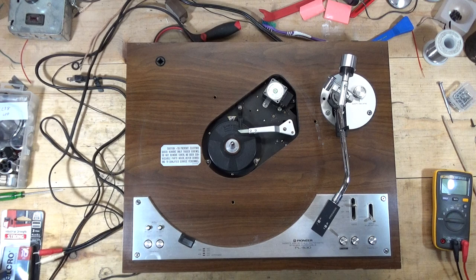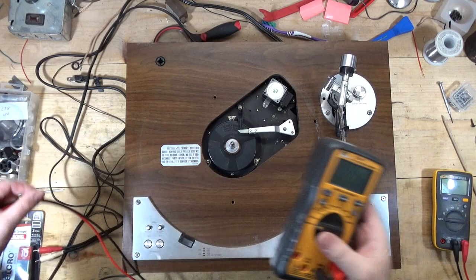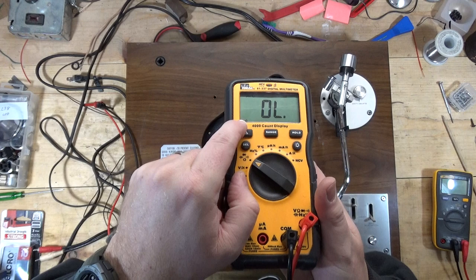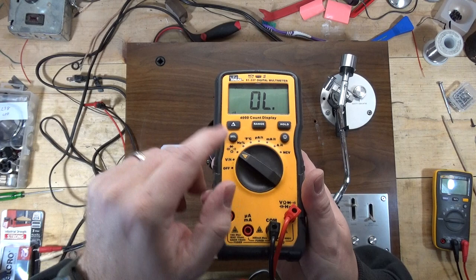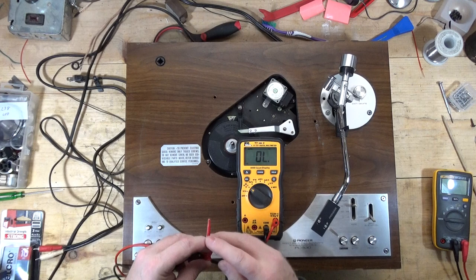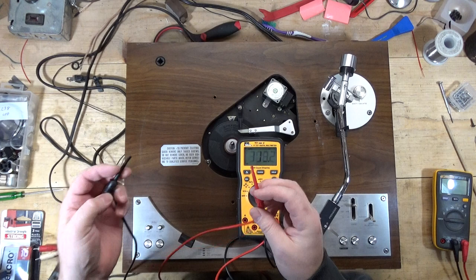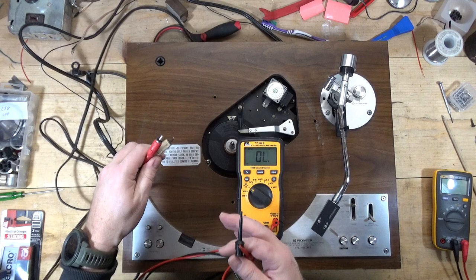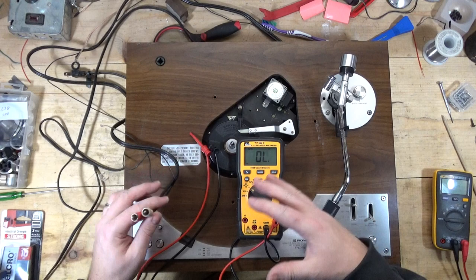What I'm going to do is use a multimeter and set it to measure resistance — ohms. There's a little tiny speaker or audible symbol on it. What that means is if I have connectivity between the two probes, it'll beep. So what I'm looking for, if I'm tracing from the head shell to the RCA cables, is I want to hear that beep. Now some turntables have a muting circuit, so if there's a muting circuit you may not be able to perform all of the tests — you'll have to perform them in stages or steps.